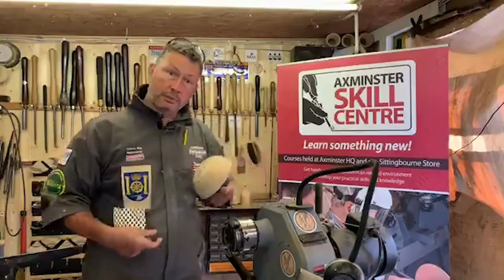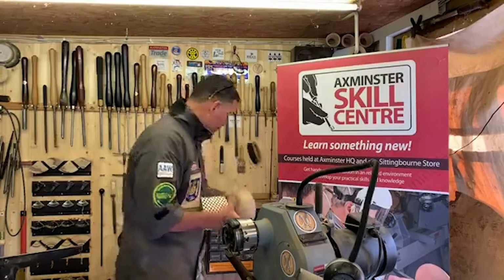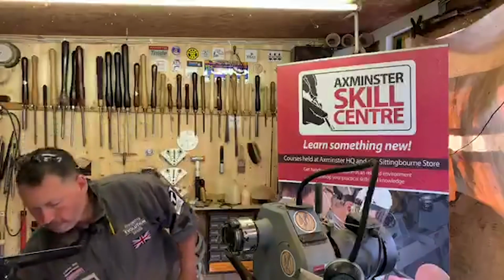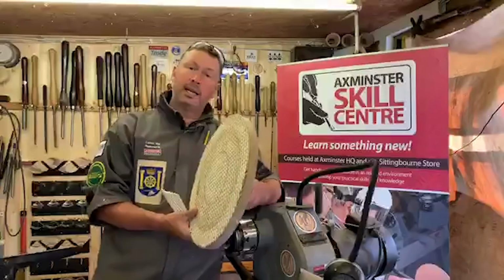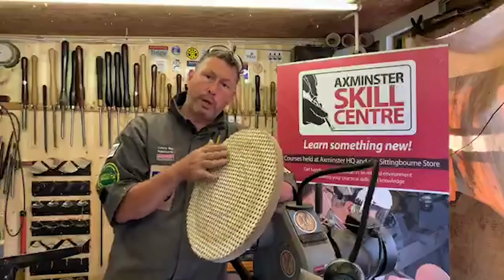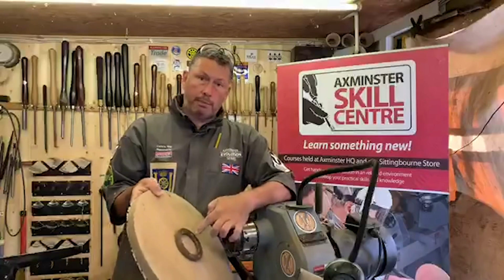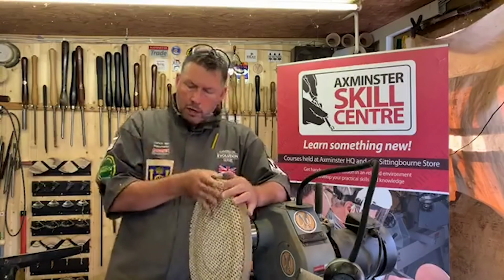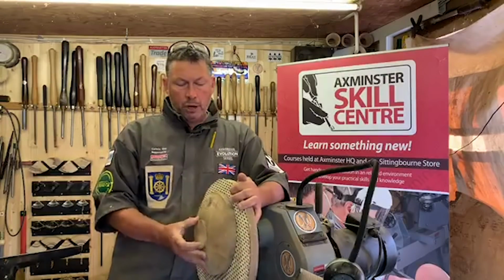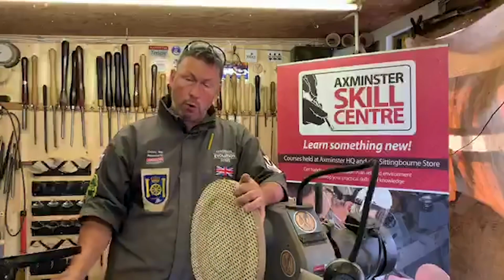If your bowl's a different shape, then you could go with a push plate. So push plates, let's pop that there a minute. Push plate is one of those, and if you've seen many of the series that we're doing now, then you would have seen me use the push plate. It's the same thing that I've just showed you there. That goes onto my chuck via a faceplate ring, and then you use the tailstock, push the bowl against the push plate, and you can start working on the outside edge. It's a very quick and simple way of working that one.